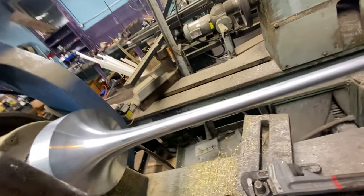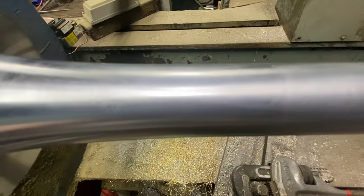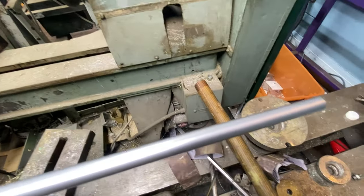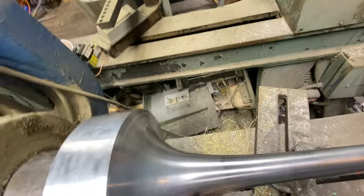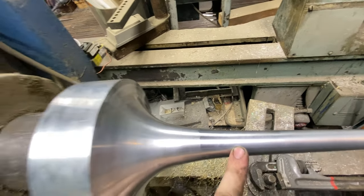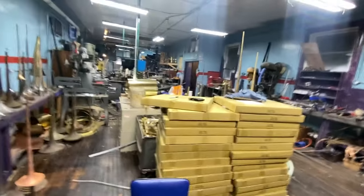Let's show you the mandrel close-up. The beautiful thing about this is usually I have to scotch-brite my mandrels, but this chrome one you just wipe with a paper towel and it just goes away. As long as you don't scratch it, it's going to be like this forever. You can see facet number one — very small facet — facet number two right there. They're more subtle on the mandrel than they are on the bell because of the springback, and that's something you have to take into consideration when designing a mandrel.